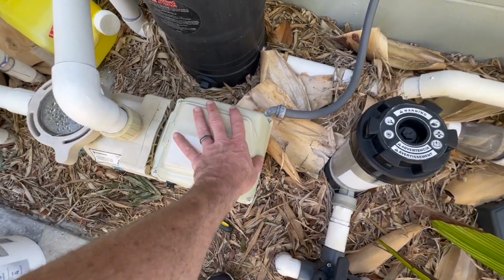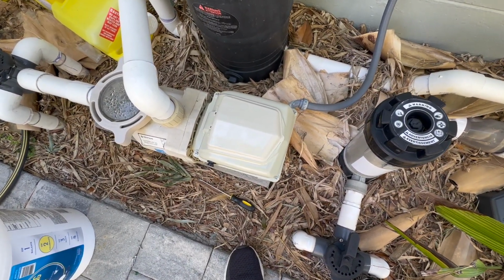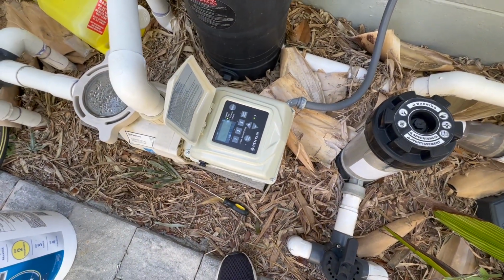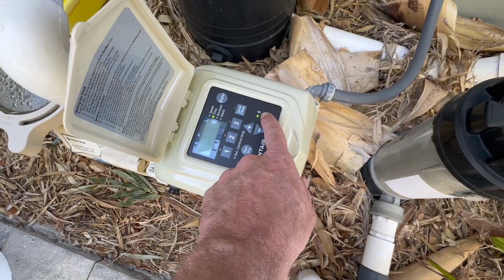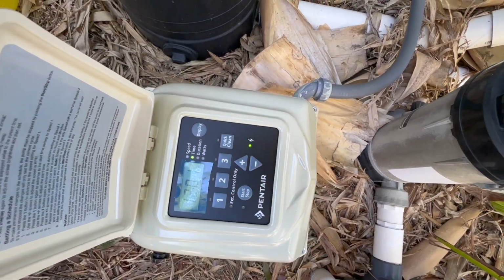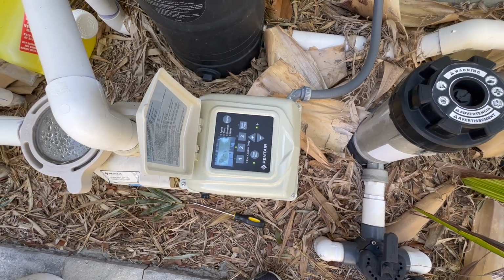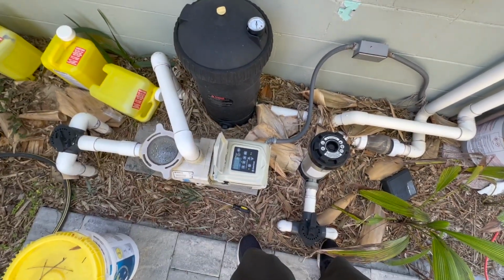And the power is now back on. And if you remember, this was completely dead. The drive was not working any longer. Looked like it had burned up on the inside. We had some heat markings on there. And so we replaced the drive and cover, the display assembly as well. And now we've got power back shown on here. Before we had power, but it just didn't show no lights, nothing on the keypad here. And so we're gonna go ahead and test it out. Go back in action.